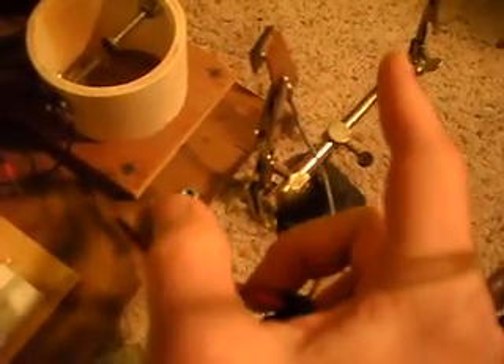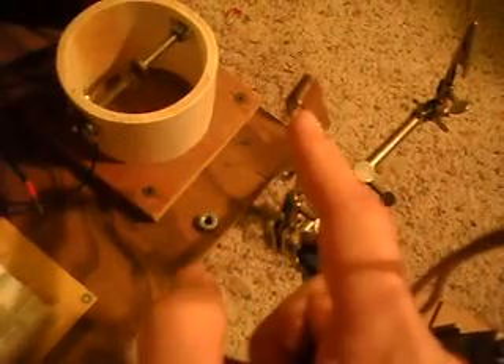I'm just going to bring this over. This is probably really hot — yeah, that's really, really hot. The reason it gets so hot is actually because this plate ionizes atoms in the atmosphere, and then since this is positive and this is negative, all the positively charged nuclei go to this plate and they have way more kinetic energy than the electrons that hit this plate, so this heats up a lot. I'm just going to hook that on there where the neon sign transformer usually goes, so now the flyback is driving the Tesla coil instead of the neon sign transformer.